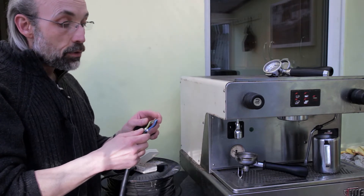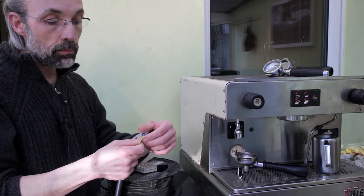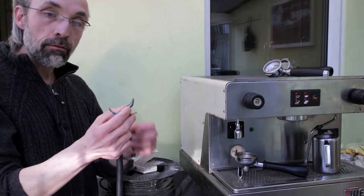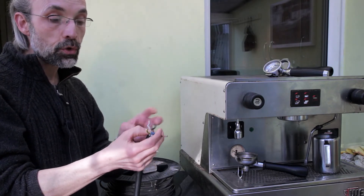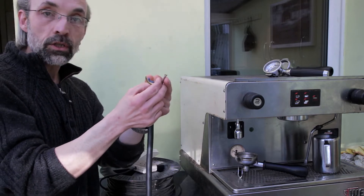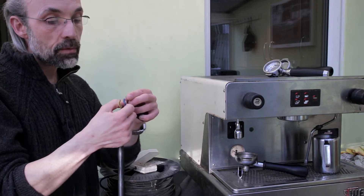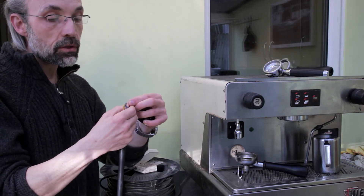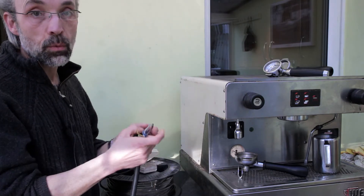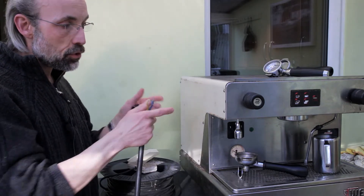What we've got are three wires which you find in any normal plug: your blue neutral, your yellow-green earth, and your brown live. In addition to that you've got black and gray, which are also live wires. In a three-phase system these would all be wired to separate points with neutral and earth likewise. In this case I'm just going to strip these wires back and all three live wires are going to be connected together — this is literally just to check what is and isn't working on the machine.